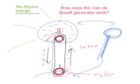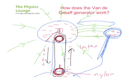Ultimately, you have a large buildup of negative static electricity on the top sphere. Electric field lines point toward it, since that's the direction a positive test charge would move. The wand, attached to the bottom, becomes positively charged as electrons are drawn off it, creating a concentrated electric field. When it gets close enough, you get a nice zap — electrons transfer onto the wand, temporarily balancing the charge until the rotating latex draws off more electrons. That's the Van de Graaff generator — lots of fun.